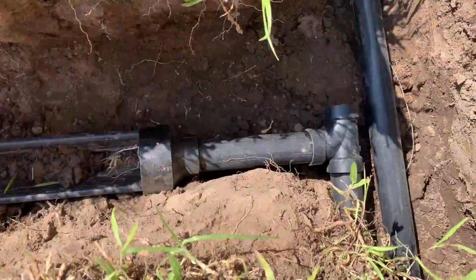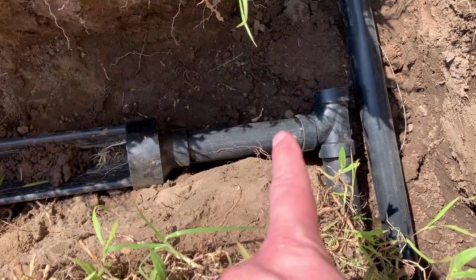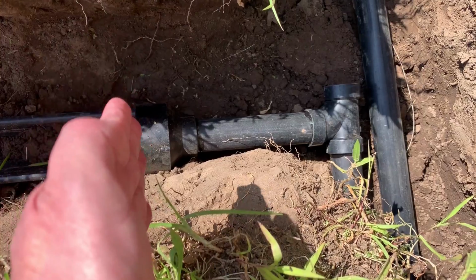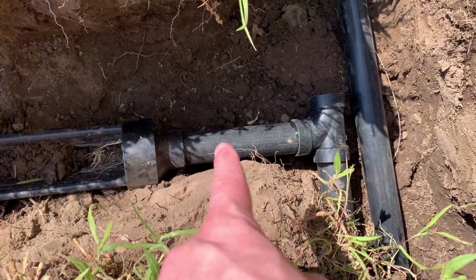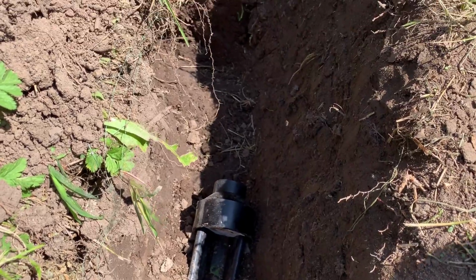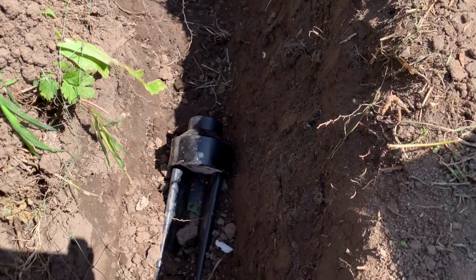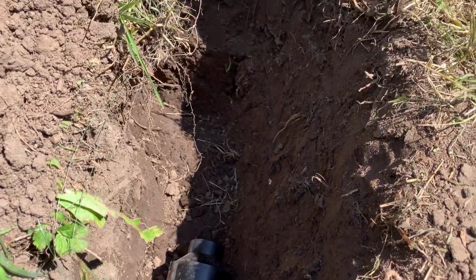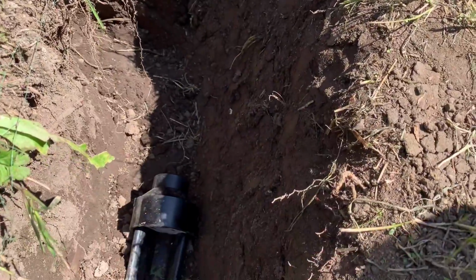If you notice that this pipe looks the same distance, but it's not. It's about a 1/2 inch to 3/4 inch shorter. Because we stopped here, that's what gave us the wiggle room. It gave us the ability to have that adjustment. Now here's another look at another aquifer pipe. If you notice, it's cut shorter than the actual trench of the header pipe. And that's what we want, because that's going to give us the room to actually connect it.